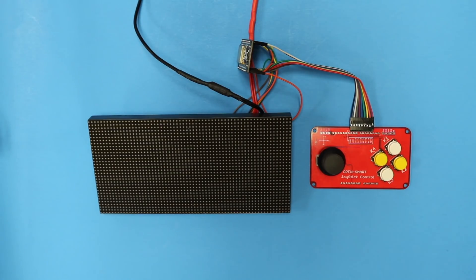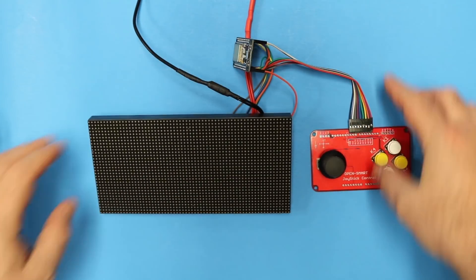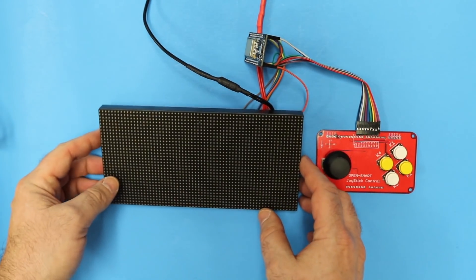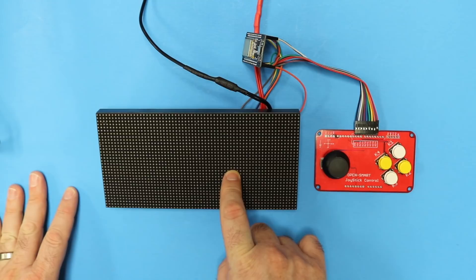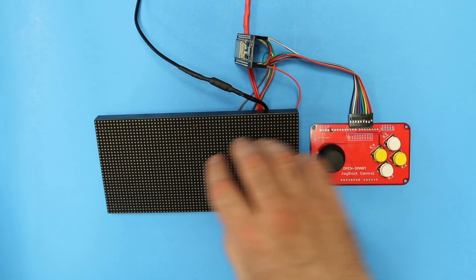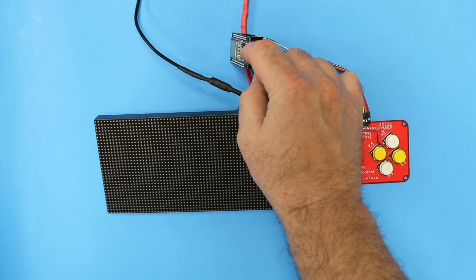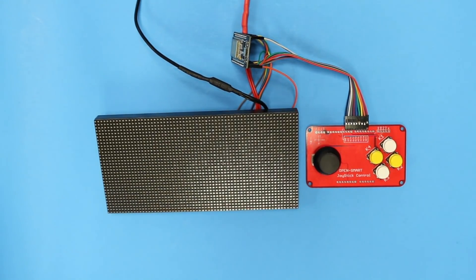To wire all these items up, the ESP32 has several inputs dedicated to the joystick controller, and some outputs wired to the 64x32 LED matrix. There's a 5-volt power supply coming in that provides higher current to the display, and also has 5 volts tapped off going to the V-in on the ESP32 controller. There's wiring information in the box guide, but let's power it up.